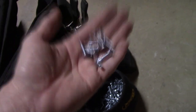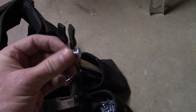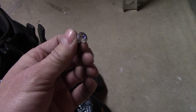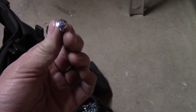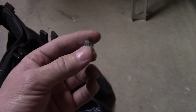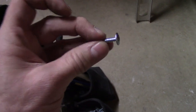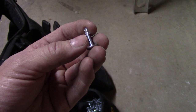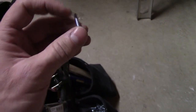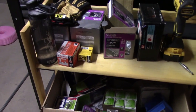I'm going to do something a little different with the screws. The regular button-head style little black ones most people use - I'm going with this one instead because it has a flatter pan-style profile, so you're less likely to see any pop-throughs with the drywall. It has nothing to do with it being silver zinc-coated - I care about that head profile. Three-quarter inch self-tappers. A half inch would have been just fine, but these are what I could get in five-pound boxes at Home Depot.